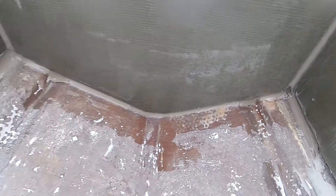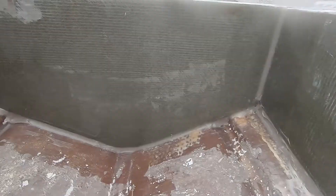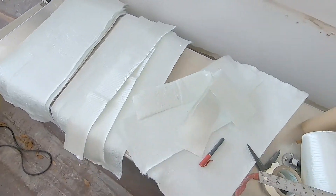Here's the radius in the corners — the radius putty looks pretty good. I need to clean up some of those corners, which I'll come back and do in a second. You can see it actually changed colors, which means it's catalyzed — that's good. When I started mixing it, it was a turquoise blue, and then after you add the MEKP it turns to a brownish color.